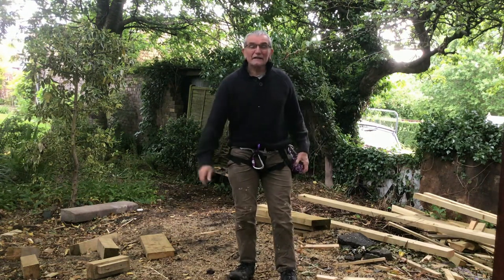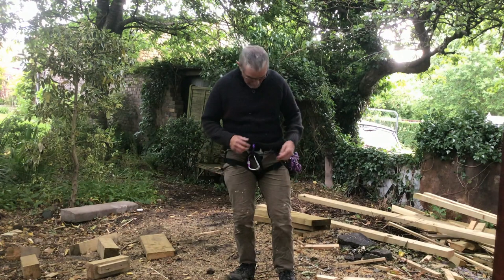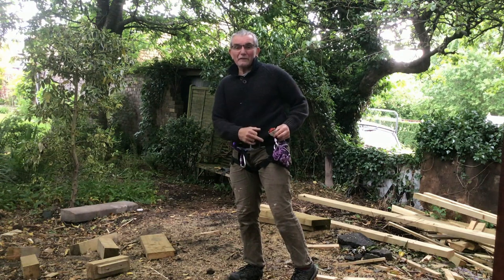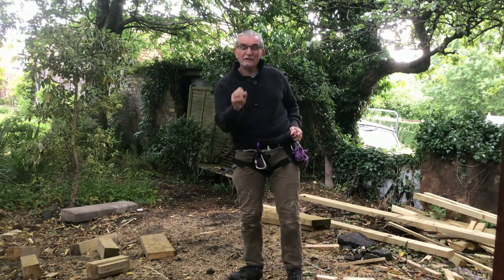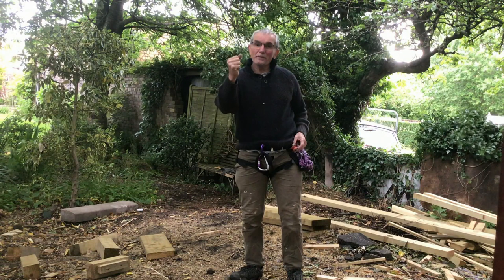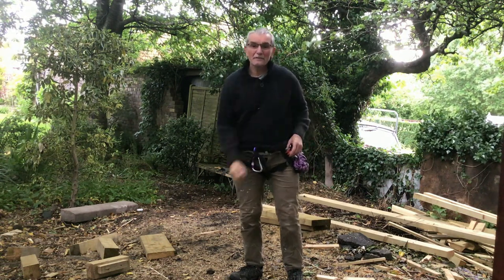and a little mechanism I'm going to use today. It's a little ratchet. I'll show you that in a minute. I've got a roller here that helps the rope to move frictionless without grabbing. I shan't be using that today because I'm only on a roof, but I'll show you this little ratchet now. So if I do slip, it'll prevent me from slipping down, but at the same time, if I want to move up, I can release the ratchet and move upwards on the rope.